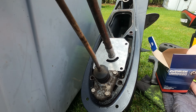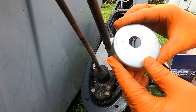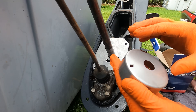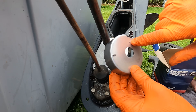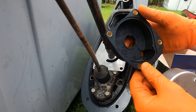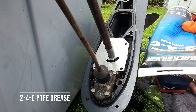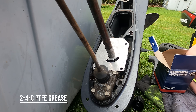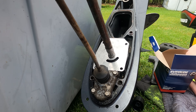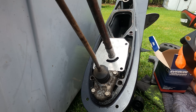Next we've got the new pump housing and insert. I'm going to put a bit of marine grease on the outside to aid removal next time. There's an air purge hole here — do not get anything on that or where it mates, otherwise you'll find it hard to prime the engine with water. Just grease the outside. There's a locating tab there as well — using Quicksilver 2-4C grease, just a small amount to aid installation, don't go plastering it on. Inside the housing there's an indent where this tab locates.